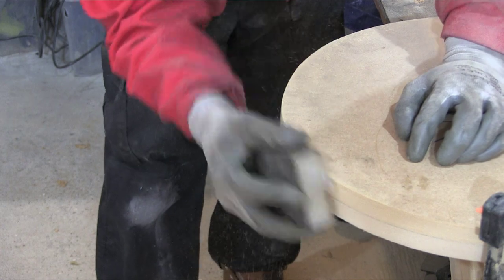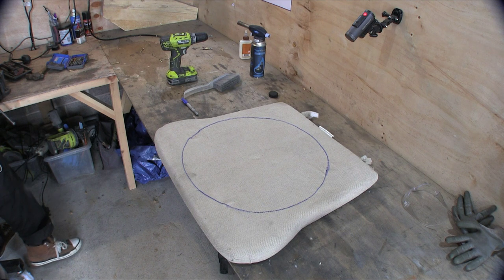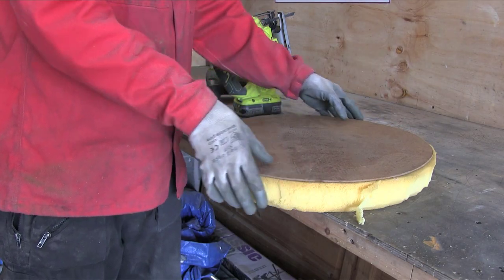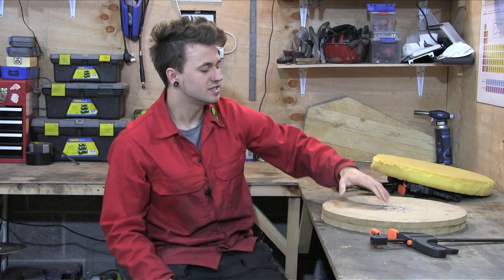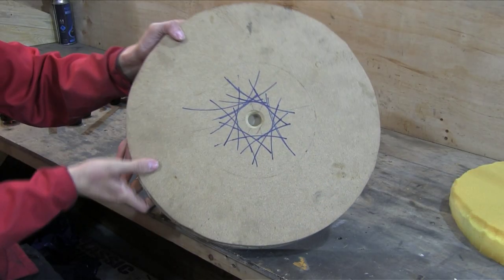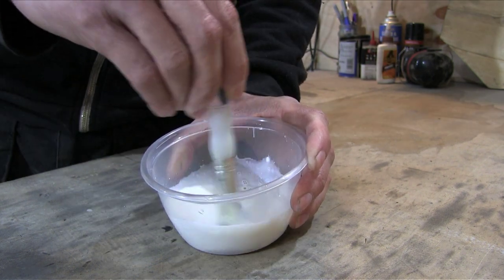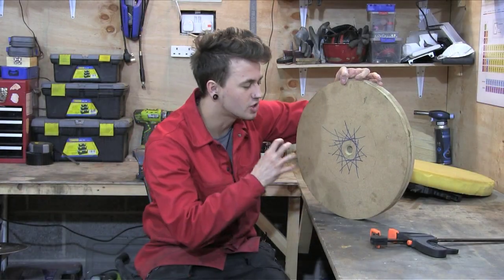I've cut this circle out of foam. I used the seat cover thing that I found just laying around and my plan is to mount this foam to a plyboard backer. Once it's covered with some fabric, I can then think about how we're going to attach it to this MDF board. But before we do that, this MDF board will need to be painted. In order to paint it, because it's MDF and MDF will soak up anything, we will need to seal it with some wood glue. So I'm going to mix up some wood glue and cover this whole thing in it, and that should prevent the paint from soaking up into the wood.